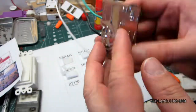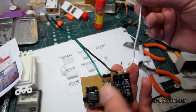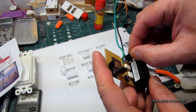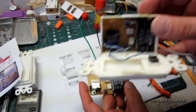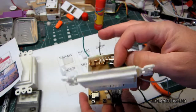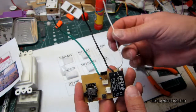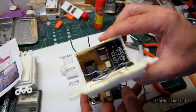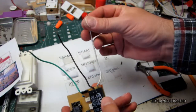I've finished soldering everything in — it came out pretty clean. I haven't tested it yet so I'm going to do that first, but I still need to make a heat sink for this guy. I did pull out my old switch from the wall as a reference — as you can see I made a kind of copper heat sink that just wraps around. You don't even need it if you're using LED lights. With this I'd keep it under 200 watts because it does heat up, but it seemed to be fine at 200 watts.